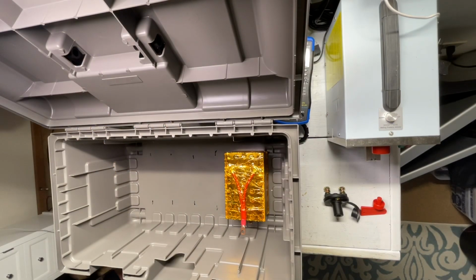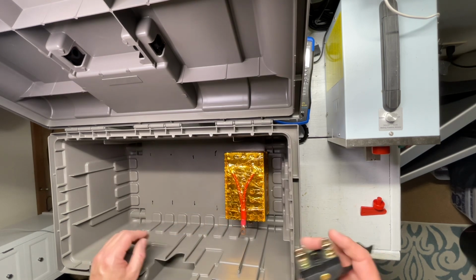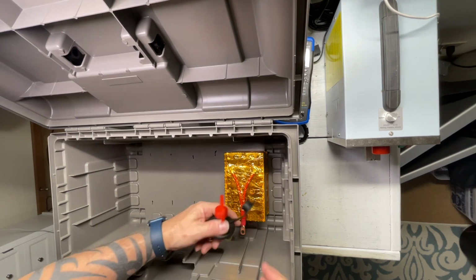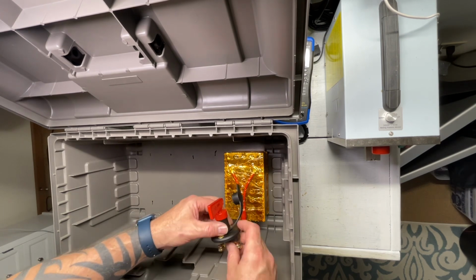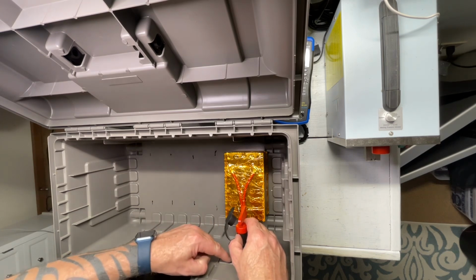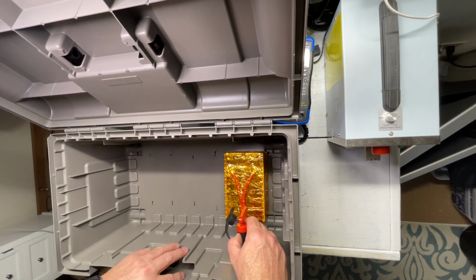Okay then guys, so on the setup, I've been looking at this, put one of the cells back in to give me an idea of where I want to lay everything out. I've got this battery disconnect, which I'm just going to put on the front here. So it'll be on the opposite side, right at the front here, coming through, easy to access. So this is literally just for the inverter. So it'll come from here, and all the other positive leads will run off this, running up to the USBs and running to our digital voltage gauge on the front.